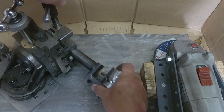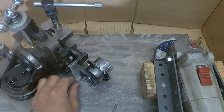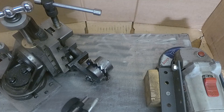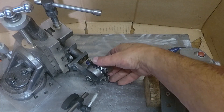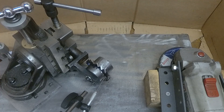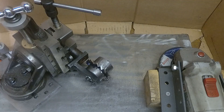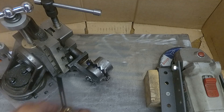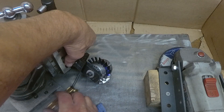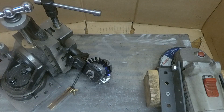We can put that in the holder, set it roughly upright to start with, and use a height gauge for just the angle of the wheel relative to the holder, so that the gap between the blades is exactly horizontal. Then every time it's indexed around, it'll hit the gap rather than the blade itself. We can set the holder back to whatever the angle is for cutting through. Camps gives about 35 degrees; I found something over 40 is probably better for the first cut.